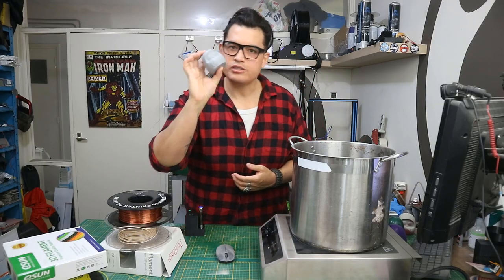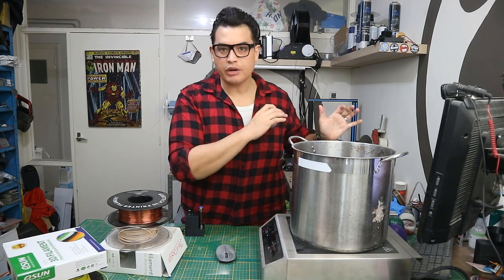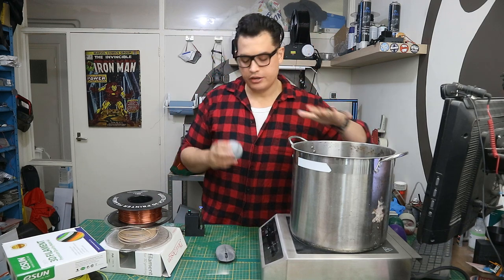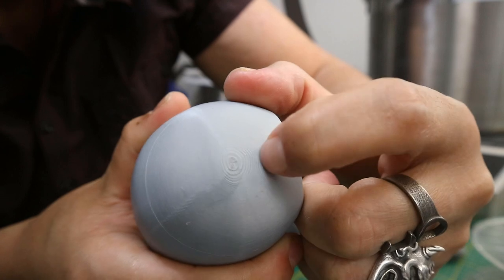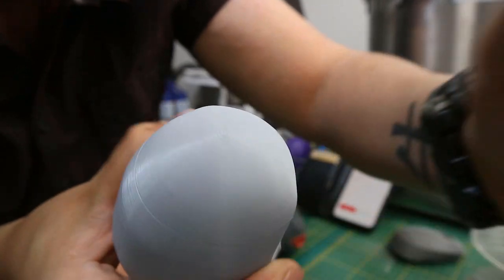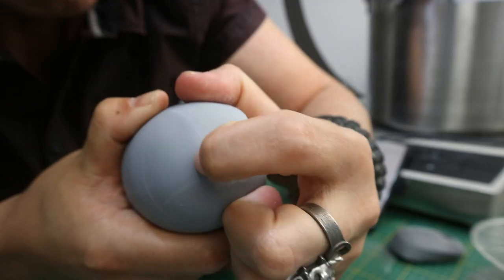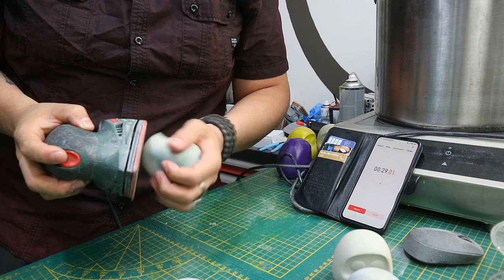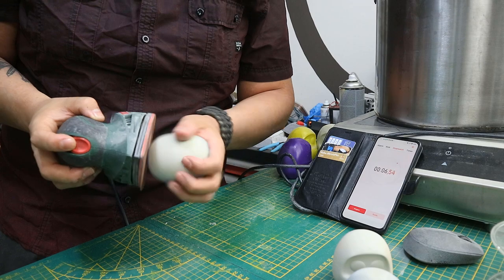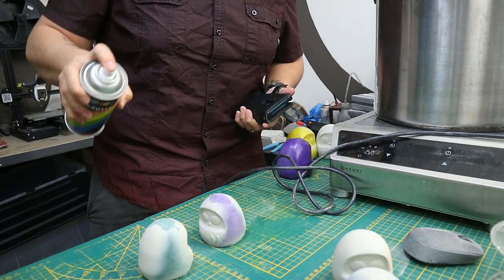I have here this Daruma print in the same Devil Design but in gray. This is fresh off the printer and hasn't been treated. Let's sand this for 30 seconds and compare it to the one we just saw. You see that same heavy stepping on top, and now let's sand this for 30 seconds — you can see the stopwatch. While I was at it, I sanded the eSun PLA Plus green and Hobby King purple PLA as well for more comparison material. Since they smoothed somewhat less, I topped them off with some filler again so we can compare them better.